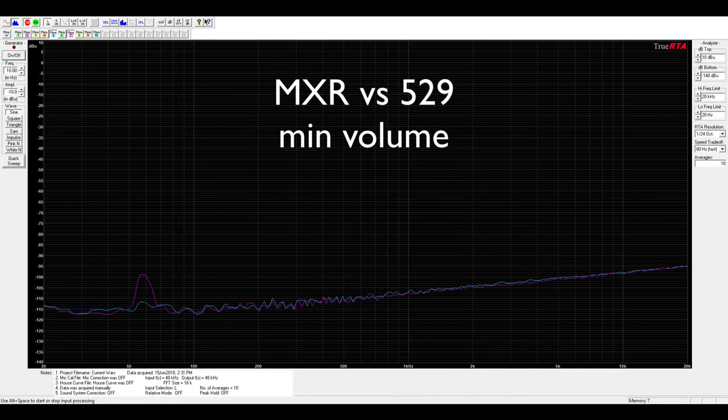Both of these are actually very quiet. Even the 60 cycle peak on the AC supply is at -98 dBU, which is actually slightly less than the -95 dBU at the very top of the noise floor.